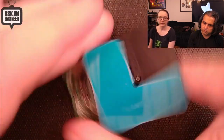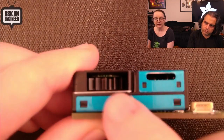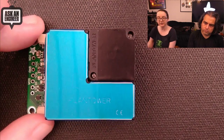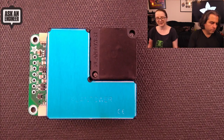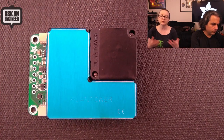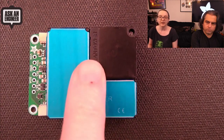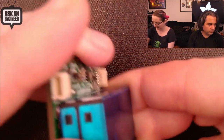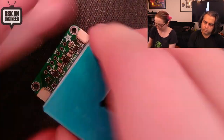And then I also have — this is kind of fun. People like these air quality sensors. They have a little fan in them and then a laser to count the particles, like the PM 2.5 particles. The only thing that was annoying about them is they were all UART connected, so they were a little difficult to use with Linux computers or even a microcontroller. If you had a microcontroller that didn't have a software or hardware UART available, you wouldn't be able to easily use those sensors. But this one is I2C capable, so I made a little breakout for it. It actually plugs in — it's got a little plug here, so you just plug it right in. It can only plug in one way.